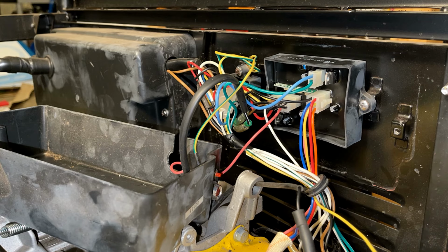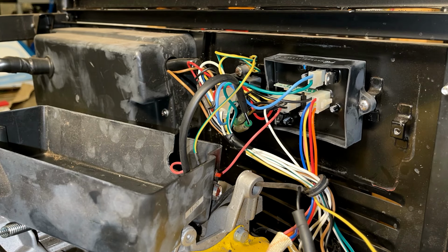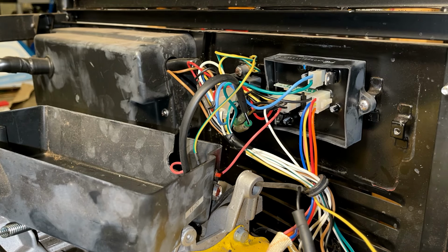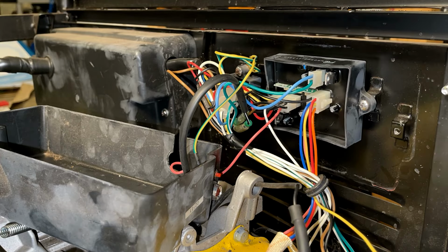But this one has a third way of killing spark, which is this guy here. So maybe this is malfunctioning, or maybe it was sensing that the generator was producing too much voltage and killing the engine. So I think before cutting any wires, I want to get this back outside, start it back up with this plugged in to see if, now that the voltage is corrected, this thing keeps running.